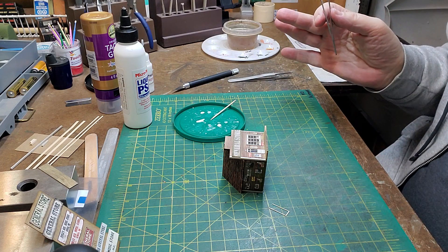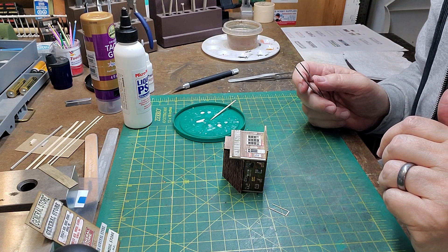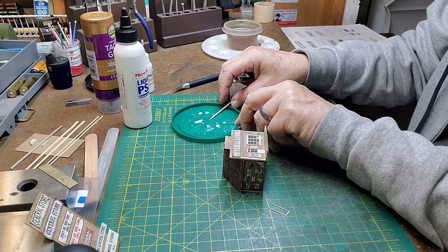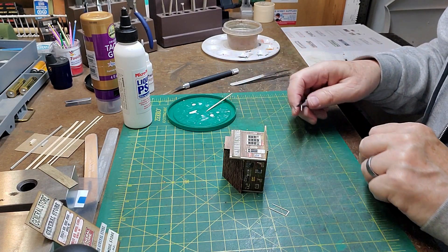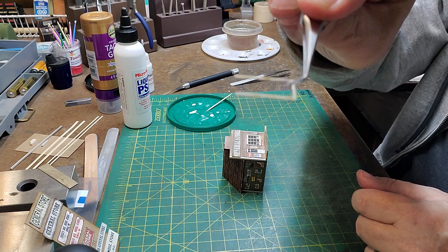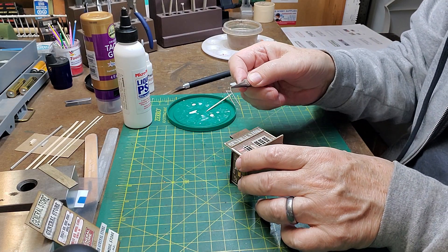But you say it's drying — it's not going to be any good. Wrong. As it cures, it becomes an adhesive, just like your adhesive on Scotch tape. It doesn't take very long, and you can see all the little puddles here — those are all cured PSA. Once I can look at it and see that it has a dull shine on it, then I know that it's cured, and it's just like the adhesive on the back of tape.